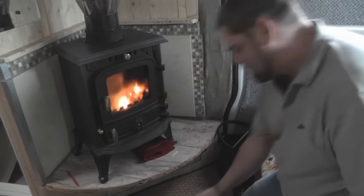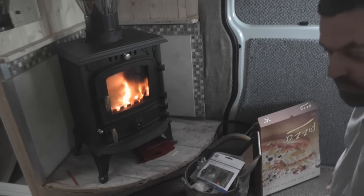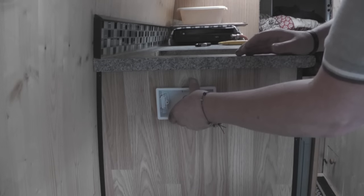I'm going to attach and fit it up now. There you go — that's how quick it is to get one in. Right, so I've fed a cable through — fed it under there, back of the fridge, up the top here. There she is — stripped and ready. I've put the socket against the wall there and marked it up ready.